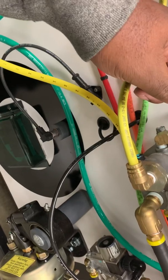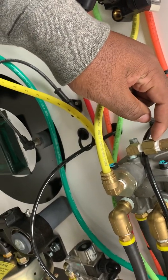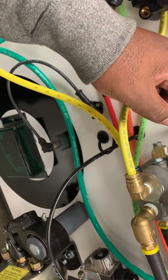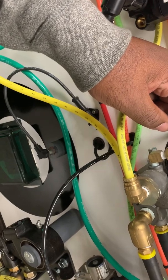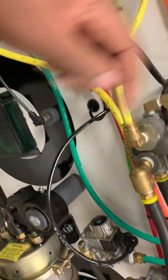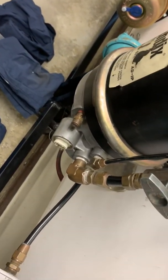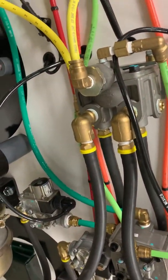Some ways this valve may fail: even though this board is set up for educational purposes, normally we don't want to add Teflon tape when putting fittings back in — that is shop dependent, but generally we avoid it. A normal way this valve fails is from Teflon tape getting into it over time. Looking at one of our older air boards, you can see that even one not exposed to the elements still shows Teflon tape deteriorating, so debris intrusion from Teflon tape going into the valves is a common cause of malfunction.